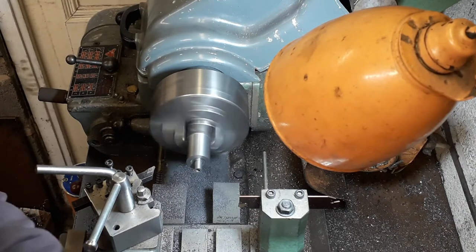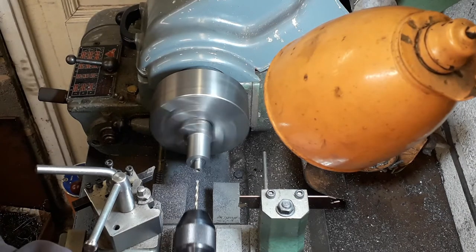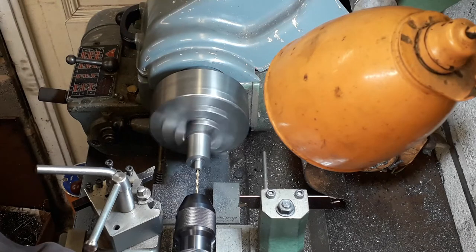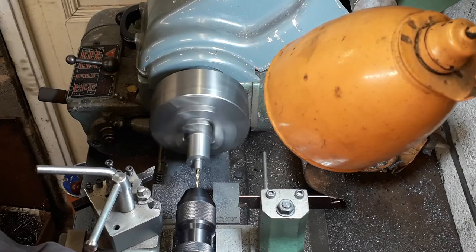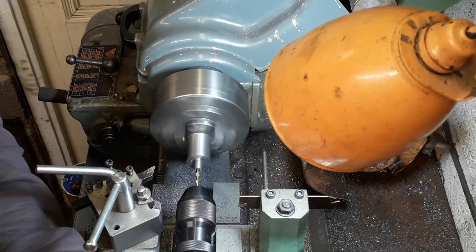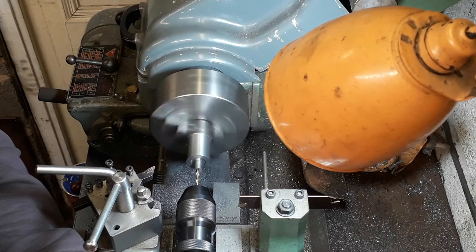This is the eighth inch one going through centre. This isn't as critical with the depth because we're going to be parting this off - as long as you just go into where you're going to be parting off, that gives you your eighth inch right through. But don't go too crazy, because you've got to take off your rear cover next from the next piece of bar. So this wants to be probably about a sixteenth, maybe a bit over.